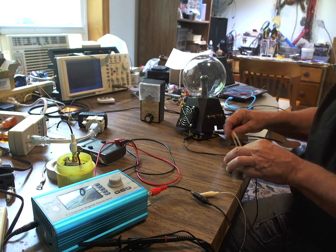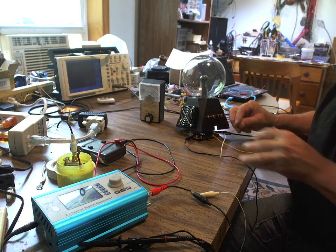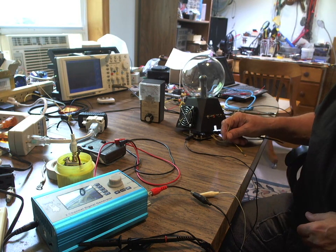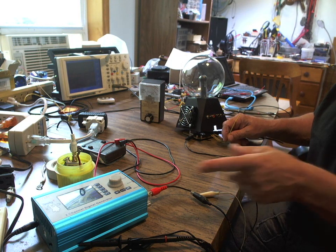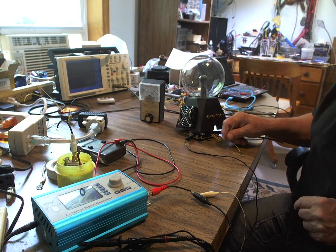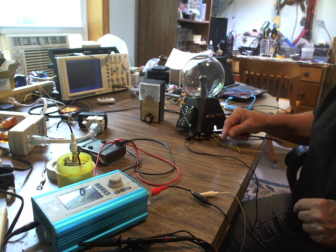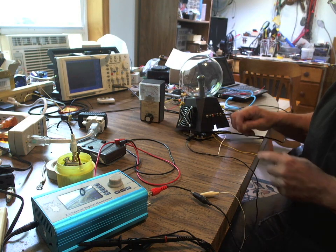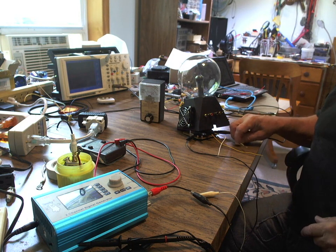There's a ground wire, there's the internal oscillator wire, and then there's the two trigger wires — one for the master channel that would connect to channel one on the Spooky, and the gating channel. They're color-coded and identified appropriately. The one with the capacitor is the internal oscillator.